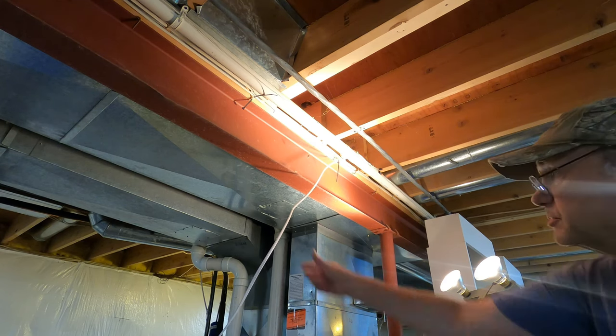Meanwhile, I got some helpful comments on the previous video that caused me to reconsider what I was doing. One commenter suggested using the blower high-speed signal to drive the duct booster, which seems like a good idea. But I'm thinking about adding a UV light to my air return. So I'd like to install a double pole relay that provides a spare contact I might use for that.